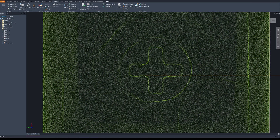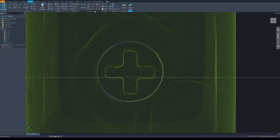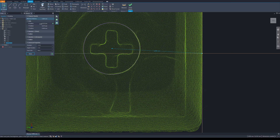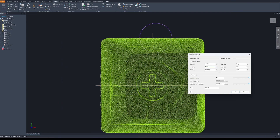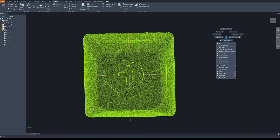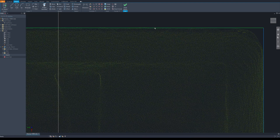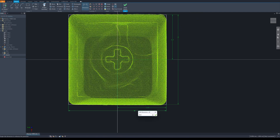I'm going to draw — create a new sketch on the XY plane and draw a circle that will match the center circle of the keycap. Next I'm going to measure the center point to the origin point — we have an X position and Y position. The center of the stem is moved to the 0, 0 coordinates. Okay, I'm going to create a new part. A square — it's 18mm. I already know that, so the measurement is 18.035mm, which is very accurate.